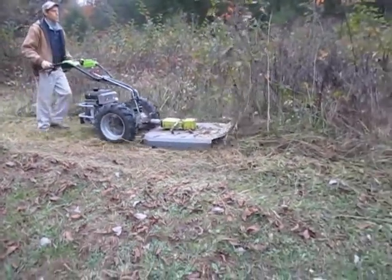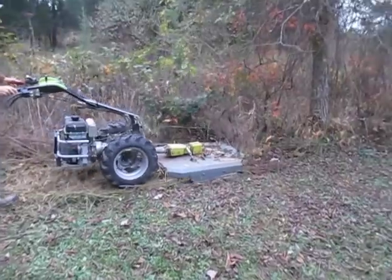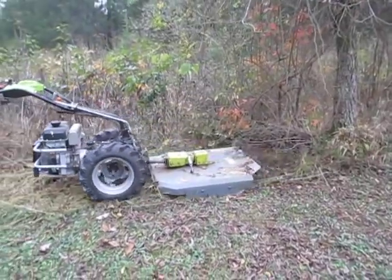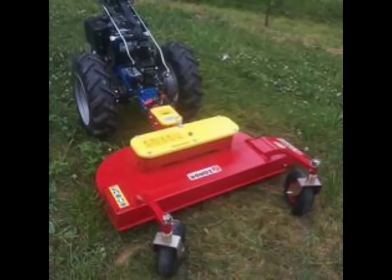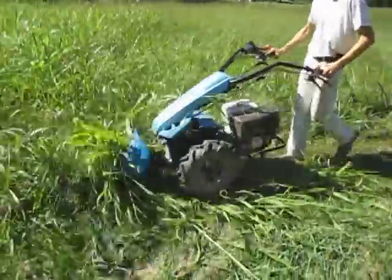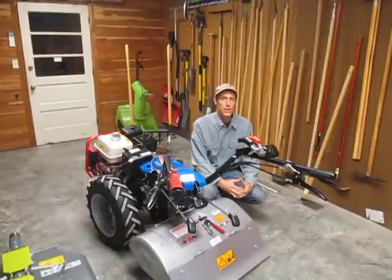From that, we have brush mowers — just like a tractor-mounted bush hog, capable of cutting larger material than the flail mower up to one-and-a-half-inch trees, but it doesn't chop it up as fine. A little less costly than the flail mower, and if what you're doing is just mowing a brush field, they do a great job. We also have lawn mowers with or without catchment systems, and sickle bar mowers — if you're harvesting hay or any kind of forage crop, these are excellent for their low horsepower consumption and wide mowing width.